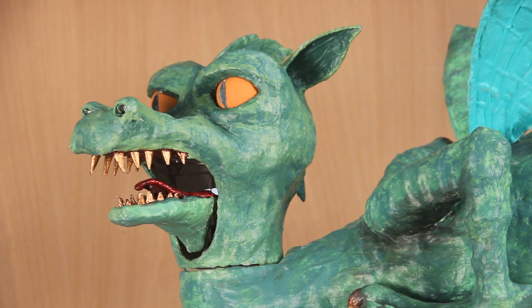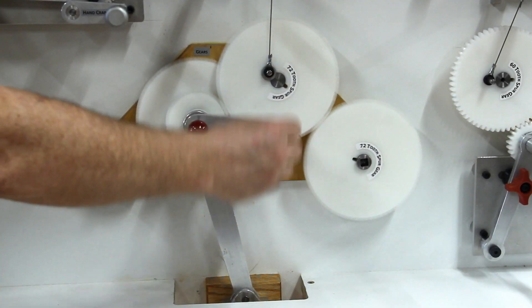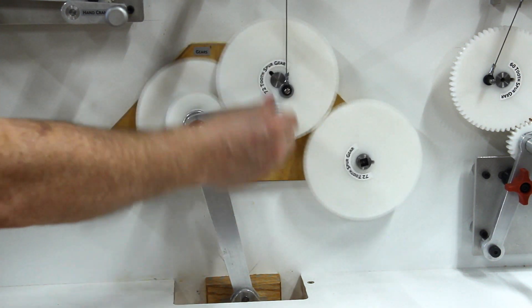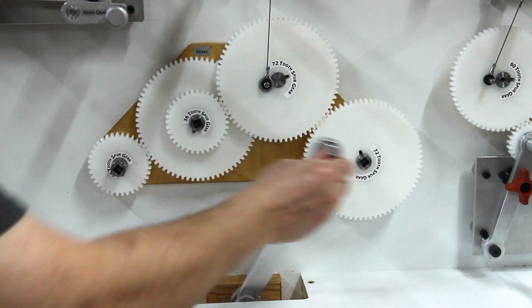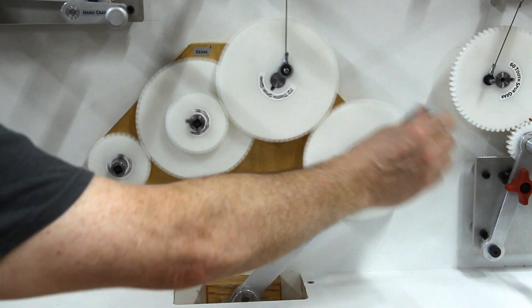The dragon's eyes shift from side to side by means of two mechanisms, one being inside the head with a bell crank and 4-bar linkage controlled by a cable. The cable is attached to a large spur gear on the panel below. This main gear connects with additional gears so that changing which one is driven changes the speed of the moving eyes.